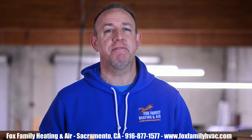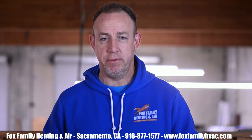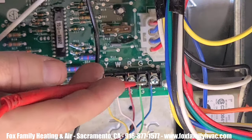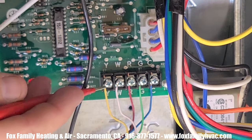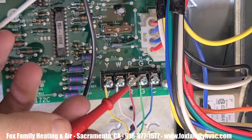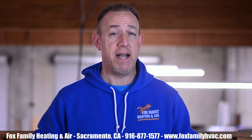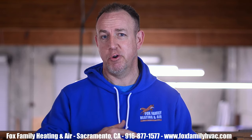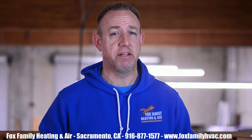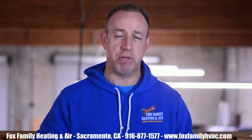So what needs to happen for the blower fan motor to start? Well, in air conditioning or cooling mode, the thermostat calls for the AC to kick on by connecting 24 volts from the R terminal to the Y terminal. But the thermostat also gives 24 volts to the G or fan terminal. The Y terminal being energized kicks on the outdoor unit, while simultaneously the G terminal being energized at the thermostat turns on the air handler's blower motor.